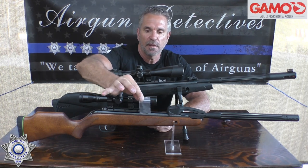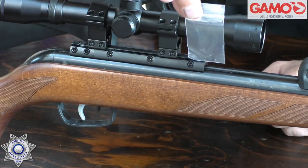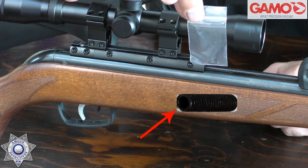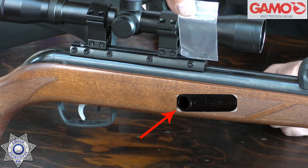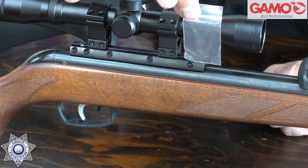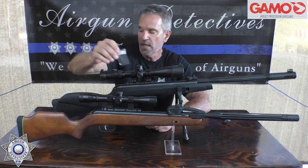Install these at your own risk. The screw itself is a metric M2.5 by 0.45 by 10mm. I prefer the 10mm over the 8mm because it gives a little more room for adjustment and more room to handle the screw when putting it in and out.